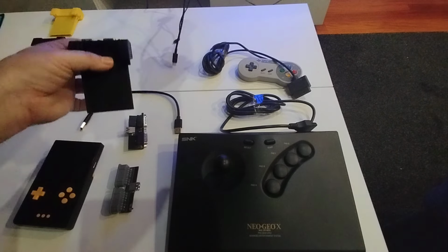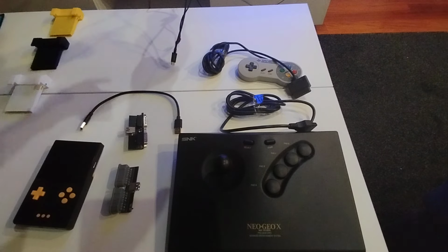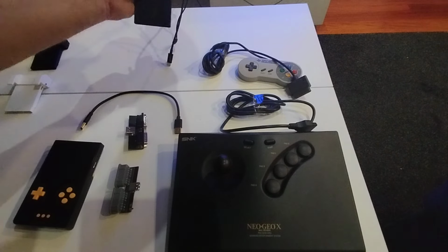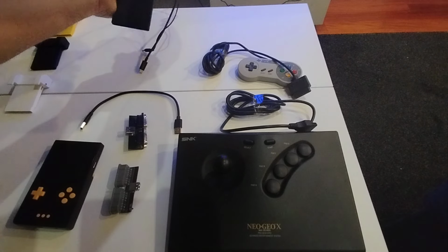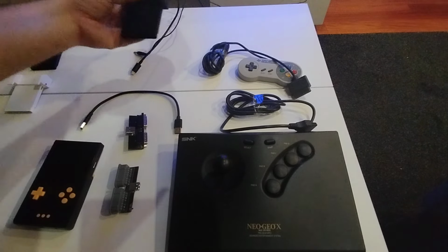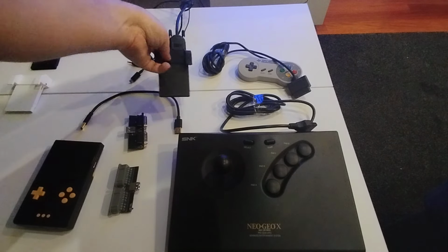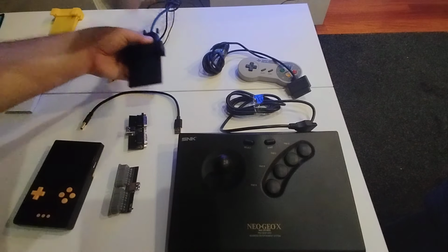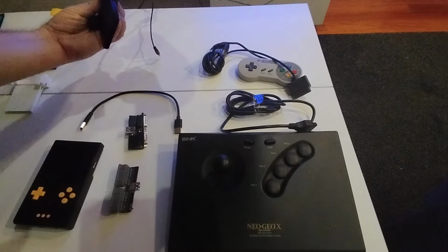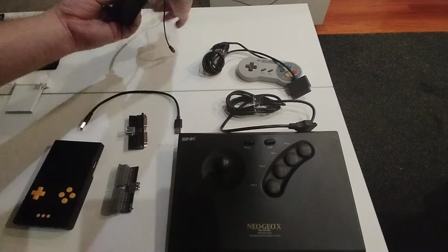This is the RGB. This is a cable that is going to a SCART connector on that TV. There is a TV there, but let's connect this. Screw this down in order to make it solid. Okay, then this also needs a small USB-C supply, okay? 5 volts, no more than that. I will connect the 5 volts here on the side.